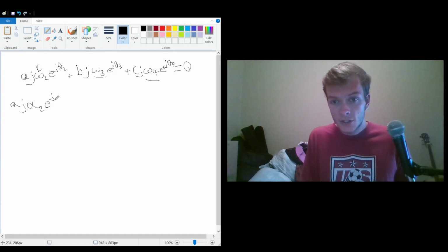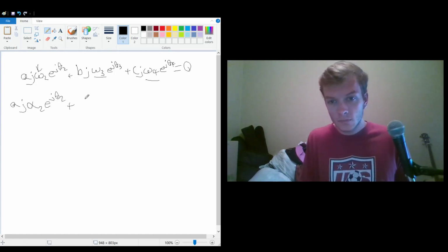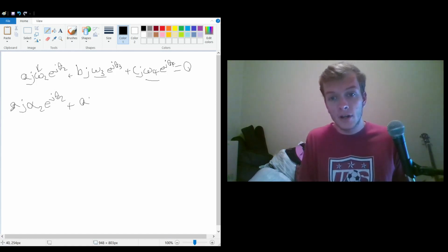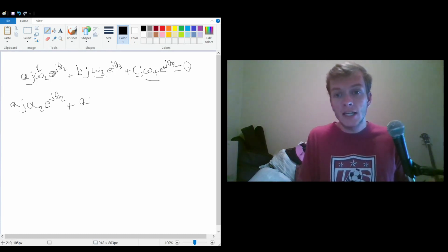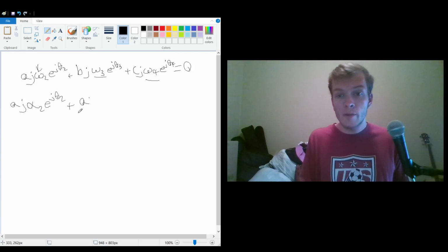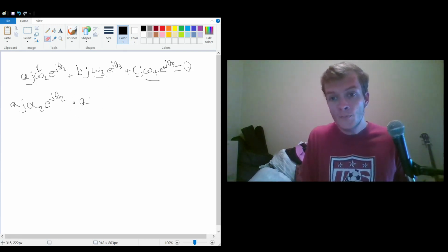e to the j theta 2 plus a, and so remember that we're not touching e, so all the other constant values stay the same. But here we're differentiating e to the j theta 2, which in the velocity, you'll remember, took a j down. So what we're actually going to do is that is going to be multiplied by this other j and become a negative 1.